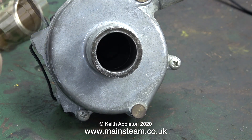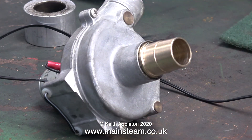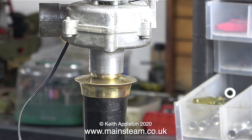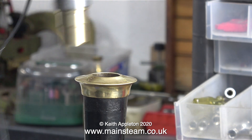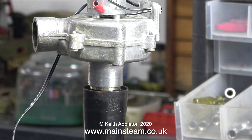The final job is to clean down the hole in the center of the blower using a piece of Scotch-Brite, then apply some Loctite 603 to the piece of brass, push it into the hole, and just let it cure. The heat of steam raising is nowhere near hot enough to disturb the Loctite bond. I think before raising steam it's a good idea to take the top cap off.